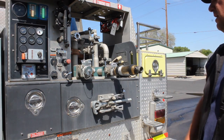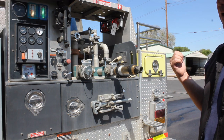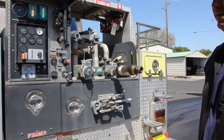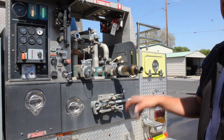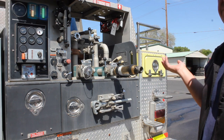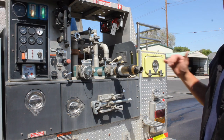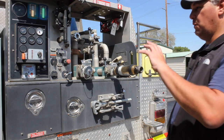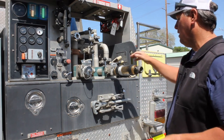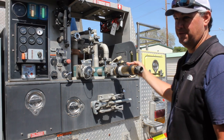So we'll fire it up, crank it up. The first or the last reading on the chart is max pressure, I think it is, or shut off pressure is what I call it. It says flowing 0 GPM. So we'll crank it up to max RPM. That's going to be our max pressure. We'll write that down, and then we will start flowing water, and we'll start doing those adjustments where we back off our throttle a little bit. We neck this down until we get about 50 PSI up there, looking for highest flow possible. Cool? Yeah, sounds great. Let's do it.